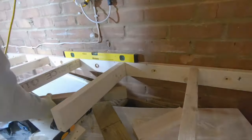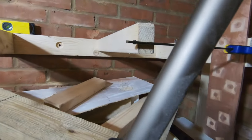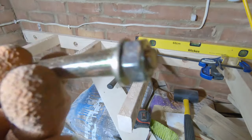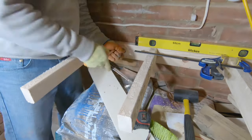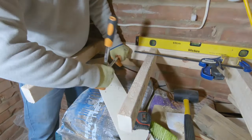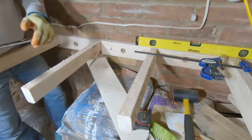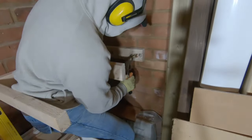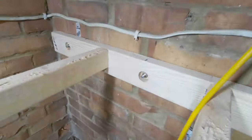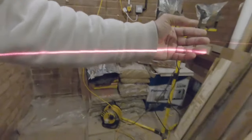With just one anchor bolt the whole system lies level, so it's critical to get the first piece right — that's the one in the middle. Once that is level you just repeat the process for all the other holes. For the sleeve anchor bolts you hammer them in using an old bolt to grip the head, then tighten with a ratchet spanner. Every 16 inches or so I drove in sleeve anchor bolts along the frame — this is how you get a floating desk with no legs. I used a laser guide just as a backup to confirm everything is perfectly level.